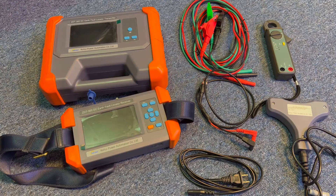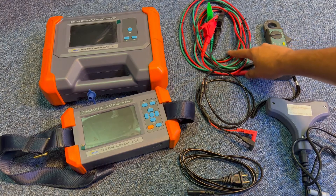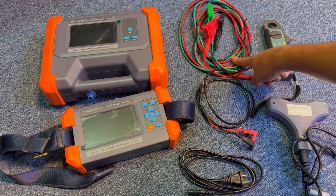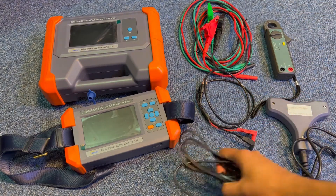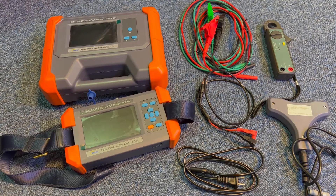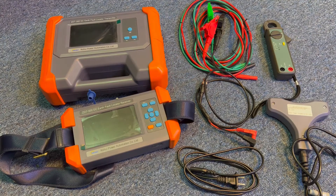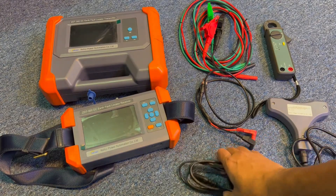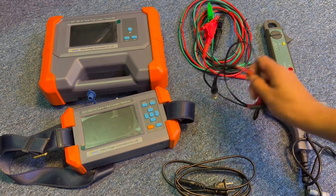This product has all these accessories: a transmitter unit, a receiver unit, and the cable which connects to the main DC DB system. The transmitter connects to the main positive, negative, and ground. There is also a power cable for the transmitter. When using it on a system of 110 volts DC and above, the system gets energized automatically. For voltages below 110V, you need to provide an additional AC power supply to the transmitter.